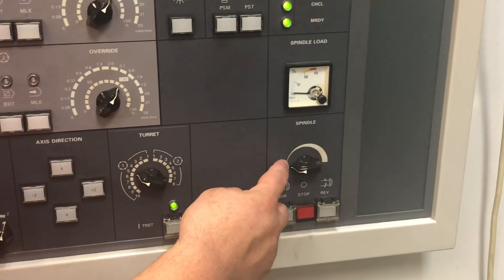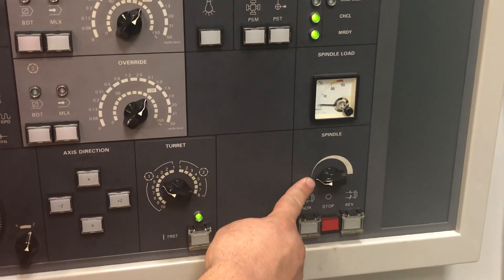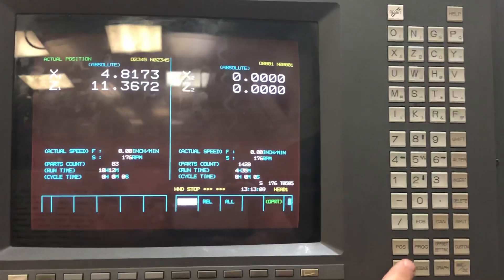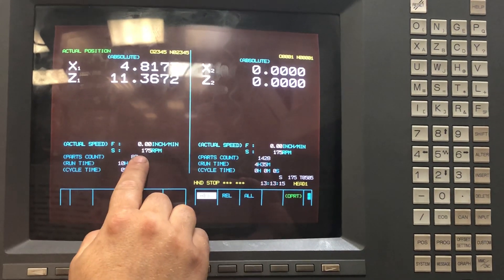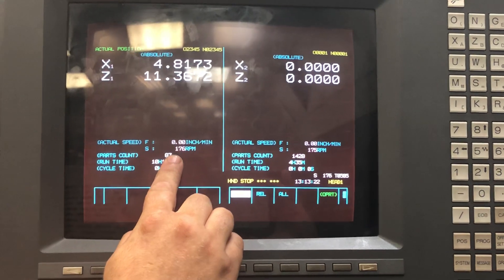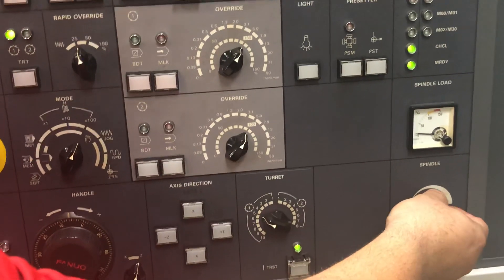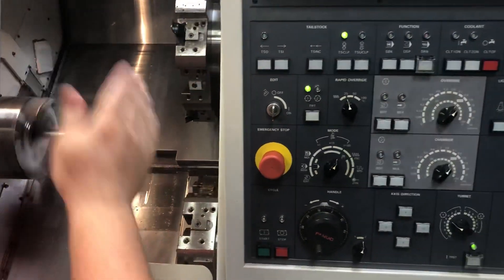If you notice, I have a speed indicator that tells me how fast I can go. Never start your spindle at full speed — always start it at the lowest amount. From the position page on my screen, it will show me the actual RPM speed of my spindle. I want to be about 500 RPM for steel and about 800 for aluminum. I'll start increasing my increments — about 490, so that's pretty close. Then I will handle down to the face of my part and take a very light facing pass.